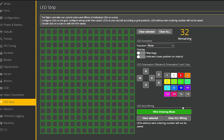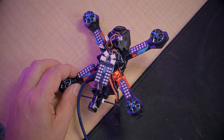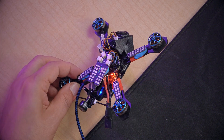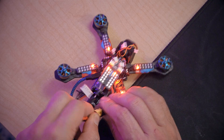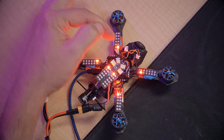We're going to enter wire ordering mode and start with one LED, then exit wire ordering mode, change the function to color, choose red, and hit save. You may immediately see that there is an LED visible — but it's not on this LED panel. This flight controller actually has four built-in LEDs and we've just addressed one of them. Now we know that LED is LED number zero. Let's plug in a battery and power up our LED panel to see the full picture of what's going on.